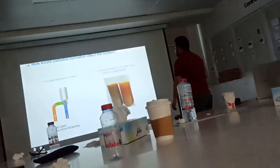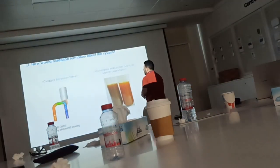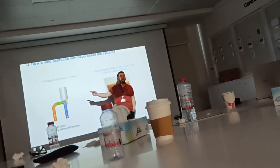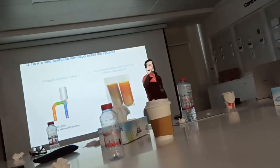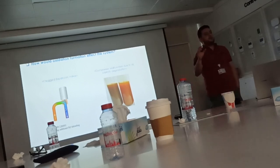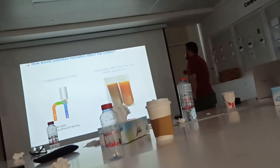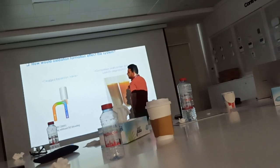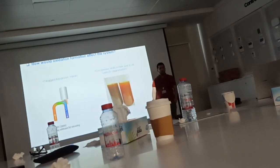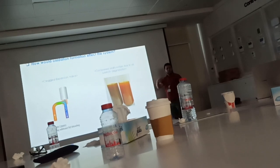It might affect the system. It can cause blockage for the EEVs of the indoor unit. So the indoor units' EEV motor can get damaged. Okay? Or there will be blockage of the refrigerant to the indoor unit, so it will not give you the proper efficiency. And you will always need to replace the EEV.